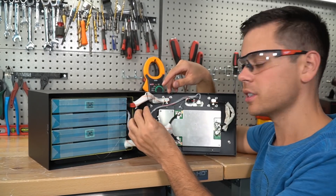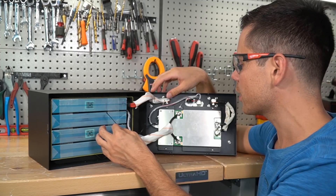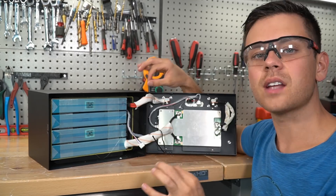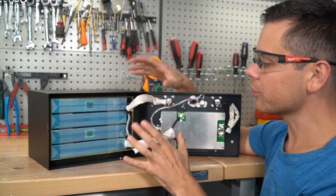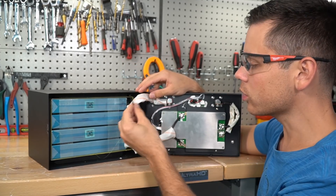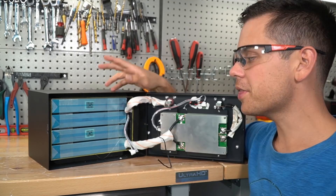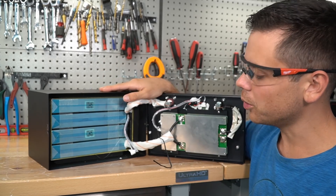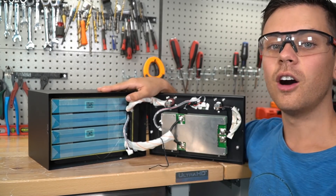Overall, I do not like the temperature sensor placement and I do not like seeing globs of solder. Most of the lithium iron phosphate batteries in this category have these bolted down with copper lugs that were terminated — I prefer that. For the price, I would go with an SOK battery. The SOK battery is cheaper and it does not have Bluetooth. I really like what the company is doing and how they made it look and all the features it has on paper, but it really needs to solve these very small issues and I think it would be a winner. This was not my favorite battery, but thank you so much for sending it out. There will be an affiliate link below. I'm pretty sure people will pick an SOK battery over this one. I hope they solve these problems — thank you so much for watching.